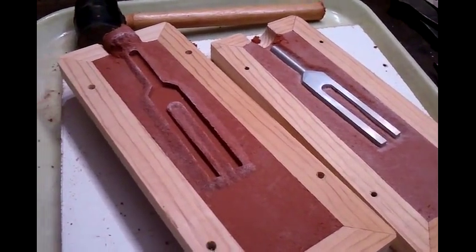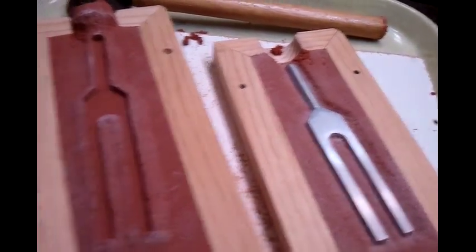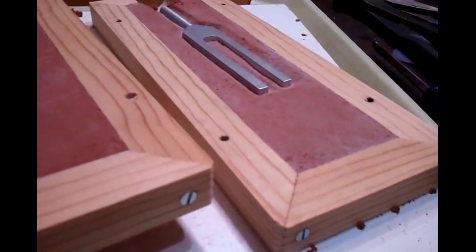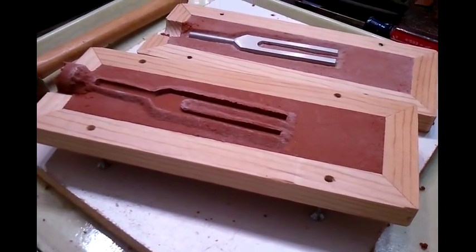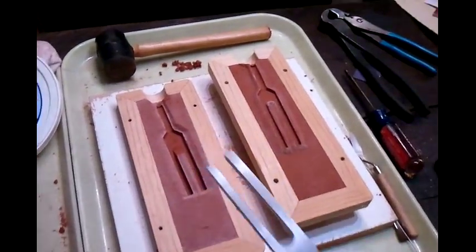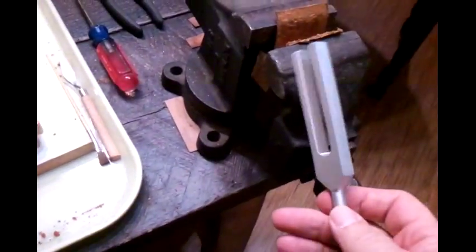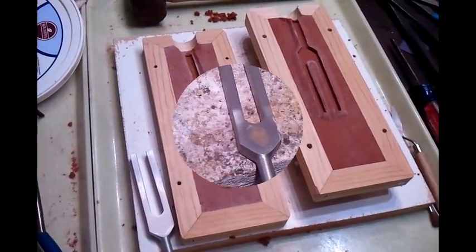Packed her up. I backed these screws out and lifted it off — it actually came out pretty dang good. Just a little bit of sand came off and that doesn't even matter; it's just that chunk you get to knock off anyways. I made this mold really thin so it doesn't take up much sand, and I can do long stuff like knives in there — those are about eight inches long, eight by three. We got it out of there. It's a tuning fork — it pulled a little sand in the crotch of that thing but I'll be able to file that out. It's way better than packing it back up again because it turned out nice.